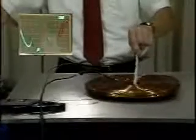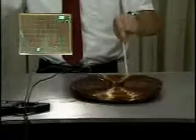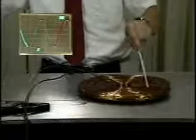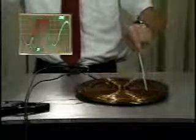The scope trace indicates the coil current. Here again is what happens as the current is raised. The force on the conductor results in vibrations which we hear as telltale evidence that the current is being increased. The force is proportional to the square of the 60 Hertz current, and these vibrations result from the 120 Hertz second harmonic component of the force. When the RMS current is large enough that the Lorentz force can overcome the coil weight, the coil lifts off the ground plane. Increasing the current further results in an increase in the levitation force, so the coil rises until the upward magnetic force equals the coil weight.